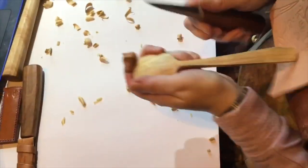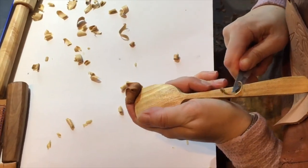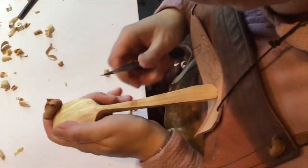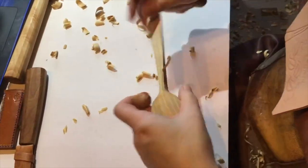So that's mostly carved now. I'm now going to put a couple of chamfers on the back of the handle, which is early. Well, it's not really. We're coming to the point where I'm going to finish off the handle. So I'm going to put chamfers in just to narrow this side even more, narrow the side profile even more. I'm still bringing the handle down to final thickness at the midpoint of the handle, and that's leaving a ridge down the center.